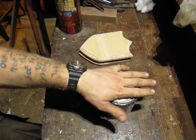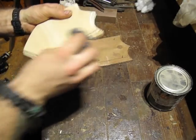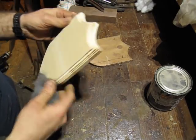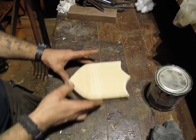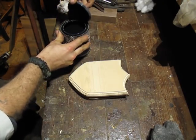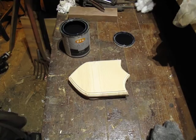So the first thing we're going to do before we put anything on here, we're just going to take a bit of steel wool and rub it all over with the grain. That will help pull the winter wood up to the surface so that when we stain this, the winter wood stands up a little higher and the grain shows through more. I'm using a thousand grit steel wool — double zero is the other name for it, depending on where you're buying it. I highly recommend the Gerber Paraframe 2 pocket knife if you're a painter — it works great for opening paint cans. Also highly recommend you don't forget to put gloves on before you open your paint, like I do every time.